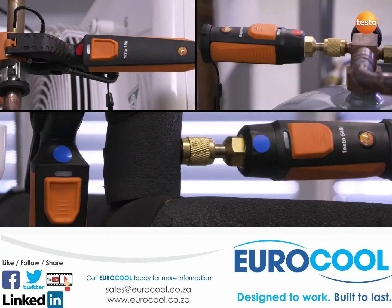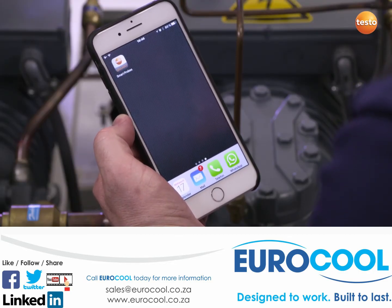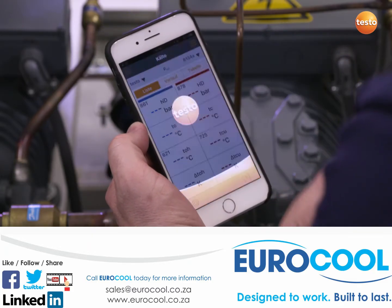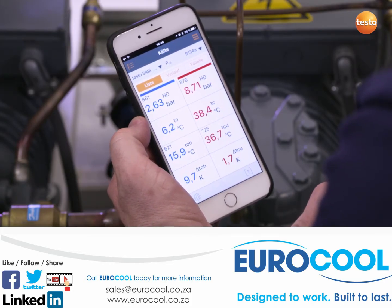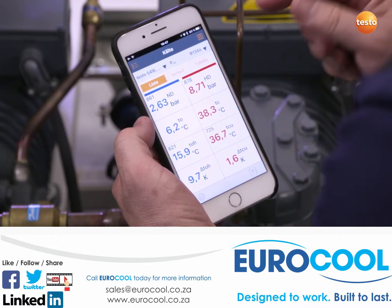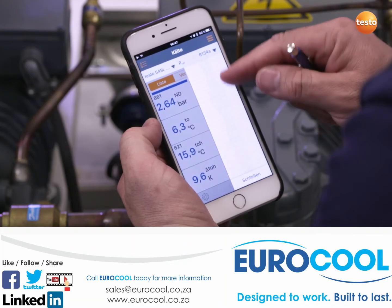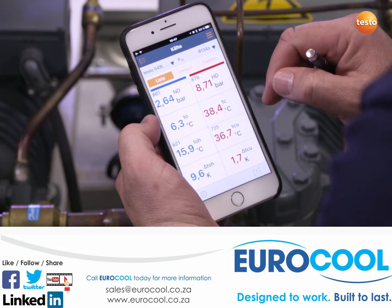This is how it connects to my smartphone. All measuring points are now set. Next, I can initiate the Smart Probes app, already downloaded for free, and establish a connection. Our four sensors are detected by the instrument. The first thing we can do is select the refrigerant that we use in the system. In our case, it is R-134A, which has already been preset.